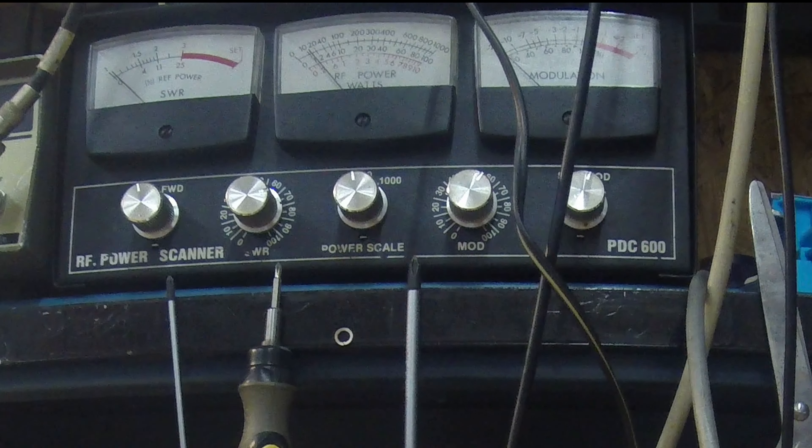I love that one watt, but what's really hot is the audio swing. It goes from one to sixteen watts dead key — that is a swing. This radio is going to talk. You can bring it up to about four watts and it swings to about sixteen watts the same way. Yeah, I'm digging that. It's got some serious, serious modulation.